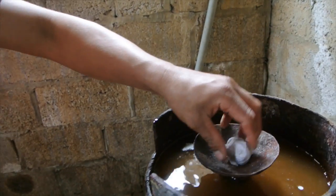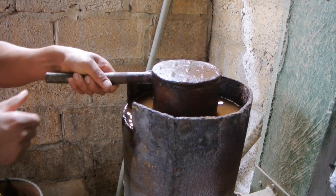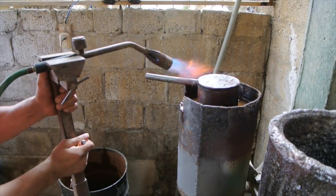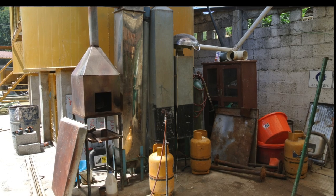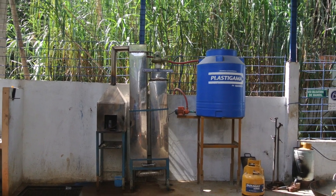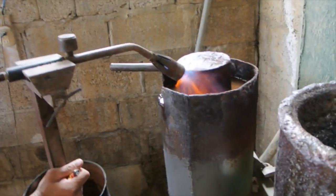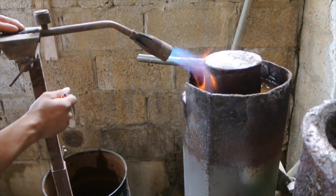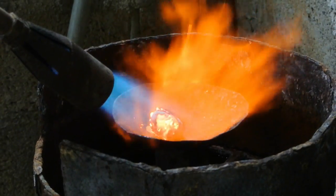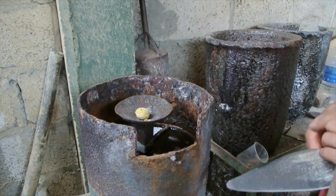The last step in the artisanal miners' process is to separate the gold and the mercury, and this is done through vaporization. The amalgam is loaded into a retort, a device intended to capture the toxic mercury vapors and condense them in the water below. Retorts come in a variety of designs, such as a cup and trough system, to larger water-cooled reverse-flow systems. A miner in Alpache saw the need for more effective retorts and has created a business buying and selling these high-end models. Unfortunately, not everyone is using these more modern retorts. After using the retort properly for 10 minutes, the miner opened the top to check on his gold, releasing the trapped cloud of mercury gas. Impatient, he burns the amalgam in the open air so he can watch the color change as his gold becomes tangible, while releasing the remaining mercury into the air and our lungs.